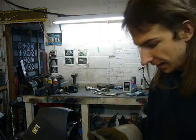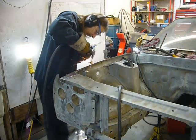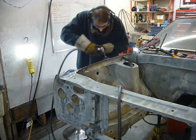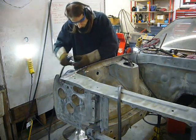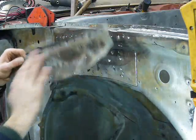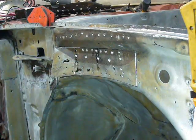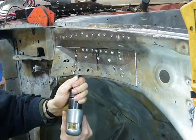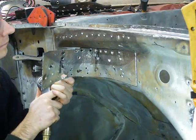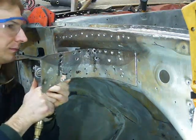I just finished welding in a piece to replace this, which turned to Swiss cheese after blasting. I've already drilled out 7 billion spot welds and removed this piece from this rusted section. Now I'm just air hammering it off. This metal is paper thin after years of rust caused by the moisture trapped between the two panels. It has about as much strength left as tinfoil.